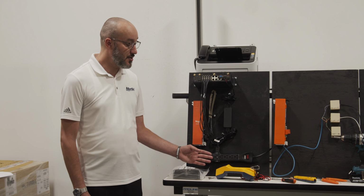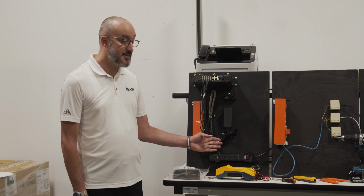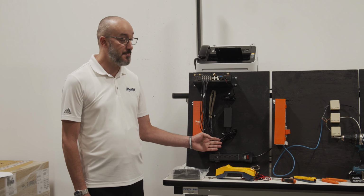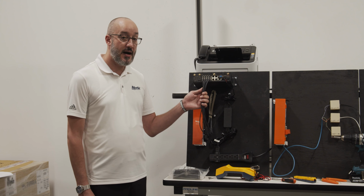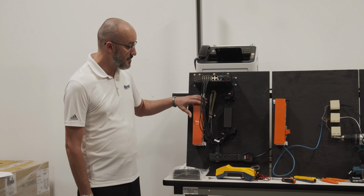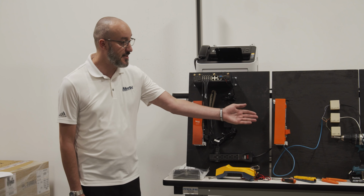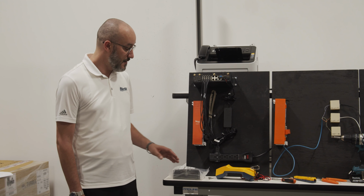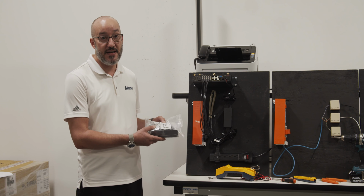On the backboard is a Tripp Lite power strip with a 25-foot extension cable. This is pre-connected to the CDS 9090's power adapter. That's also pre-connected for you with 8 Hydra cable pigtails, finally mounted to the 66 block. This 66 block will replace our existing example customer DMARC. And lastly, we have our LTE extension antenna cable.